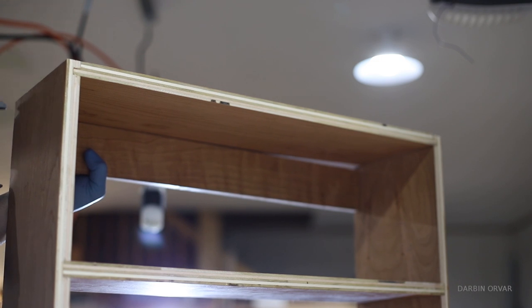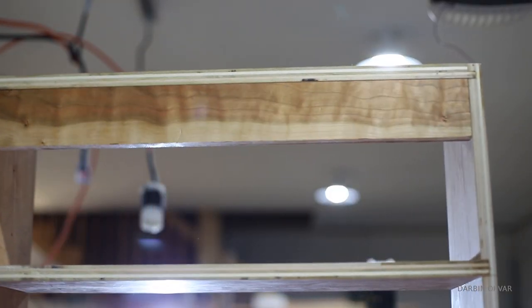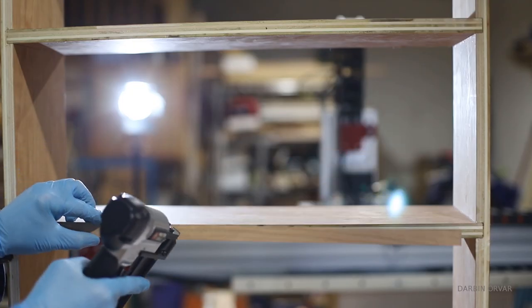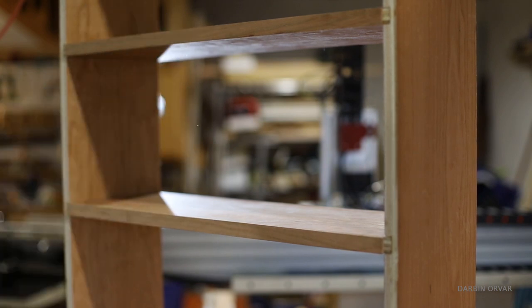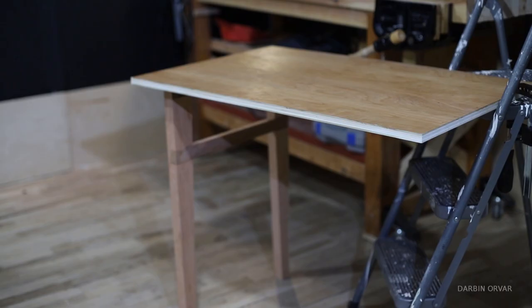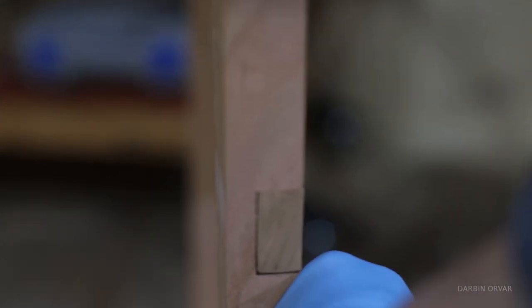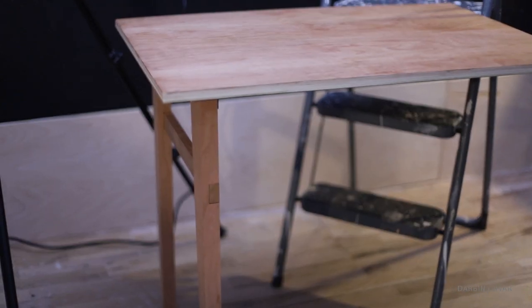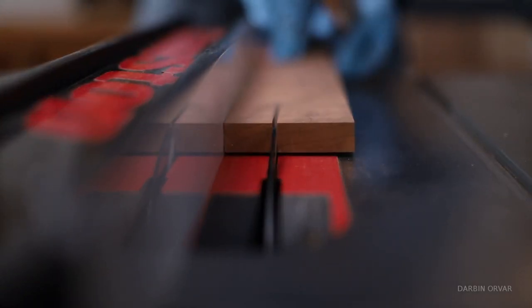Attaching a nailing strip here, and also adding trim — these are simply slivers of cherry hardwood. Next thing to solve is the question of collapse. As of right now the legs can easily bend over simply by touching, and it would be very annoying if you had a bunch of stuff on the table and accidentally kicked it in and the whole thing collapsed. To solve that, we're doing a little pinned bracket.